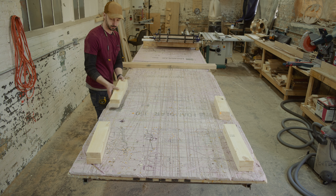The glue-up for these tabletops was a little unique. I wanted everything to be as uniform as possible, so I have one center board and then I placed three boards on each side of that center board. These three boards are identical to one another, acting as a mirror to the other side. One minor annoyance to gluing it up like that comes when you're spreading the glue — the two boards on the outside were much wider, so I had to be extra careful reaching over them to spread glue onto the smaller boards.